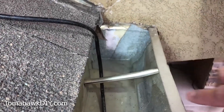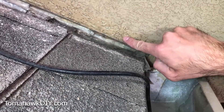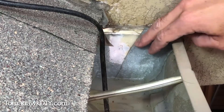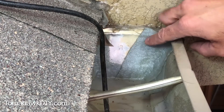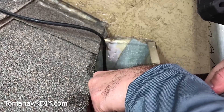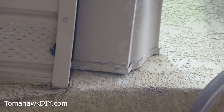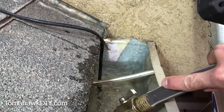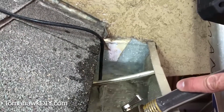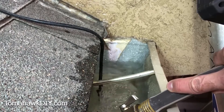Here's the completed repair after the product has dried. Leaks are gone. The corrosion over here is coated, and we've stopped water from finding its way between the stucco and the shingles. The Rubber Flex liquid can be used on its own, but for even stronger leak stopping it can be used as a system with the Rubber Flex waterproof tape for two layers of waterproof protection. We've sealed up this rain gutter — it's holding the water in place, not leaking. This two-part system along with the Rubber Flex waterproof tape stopped the leak on this rain gutter, something that the Flex Seal spray can didn't do.